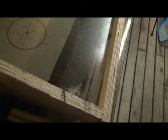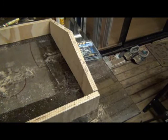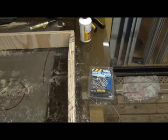For the end pieces — the end of the hive is 450 millimeters, so I've made the roof ends 455 millimeters, which leaves 2.5 millimeters each side for shrinkage and expansion. One of the great things about these plans is it's simple carpentry — just straight butted joints screwed together. No dovetails or dowels or fancy carpentry things that people find hard to do without a lot of practice. I'm going to put this together now and then look at fitting the sheet on here, getting the gable on, and finishing the roof.